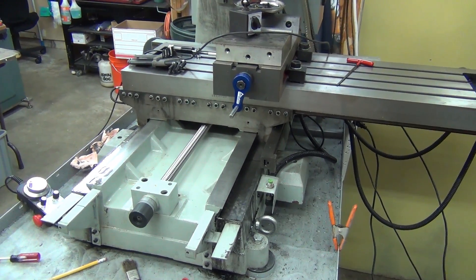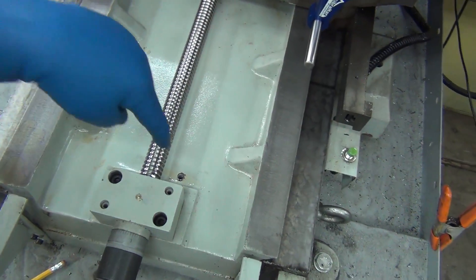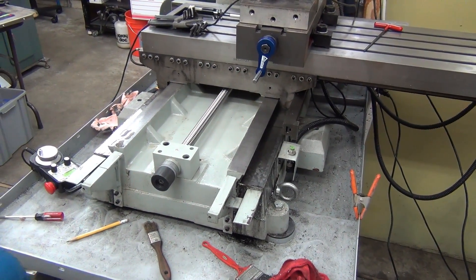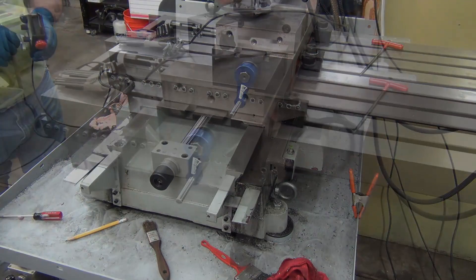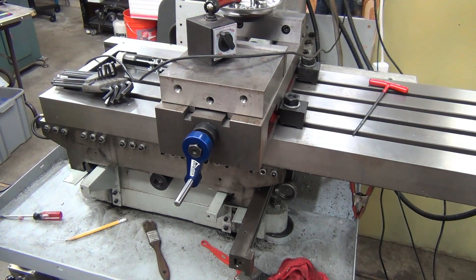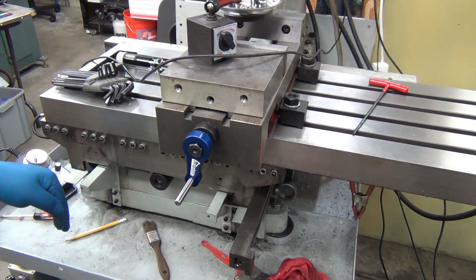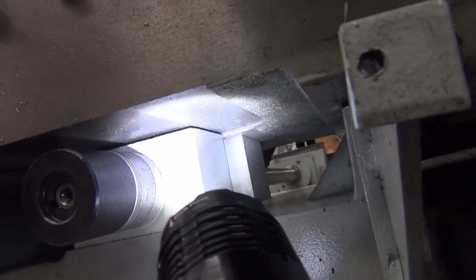While we're at it, you will find another bolt here that limits your forward travel. Taking out the back bolt and the front one is the minimum you've got to do to get anywhere close — I'm not sure what the travel is with those in, but it's not 15 inches. I have a sharpie mark on there showing where my end is. You can hear that little buzz — that was it fighting at the limit — so I backed it up just a little bit, about a sixteenth of an inch back from the hard stop. That gives us 15.62 inches.